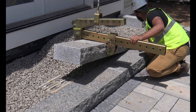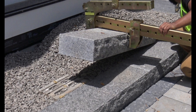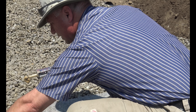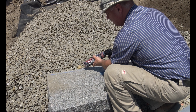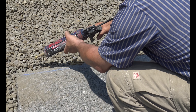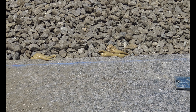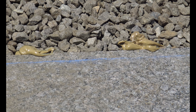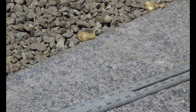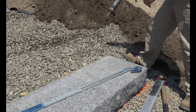A trick of the trade: sometimes you put a block behind here flush with the step to give something to glue to, otherwise you use an adhesive. What I like to do is put a nice big clump of glue behind my stair and have a little bit lap over the edge. Once it hardens up it acts like a hook — it'll grab and pull. I do quite a few of these, I'm not shy with the glue. That one-inch overhang, once locked in, will keep the step from pushing out over time.